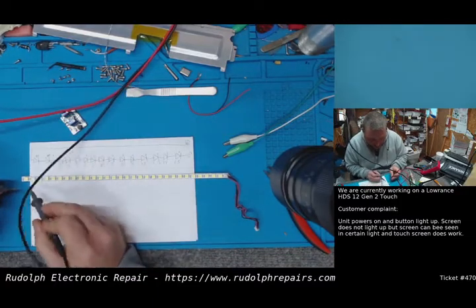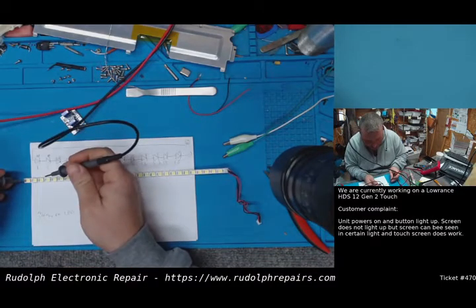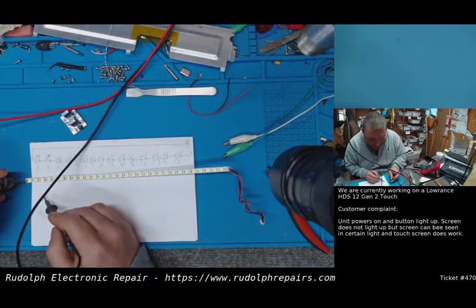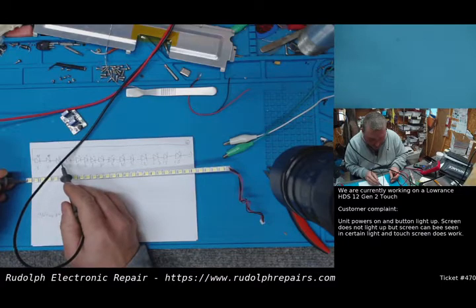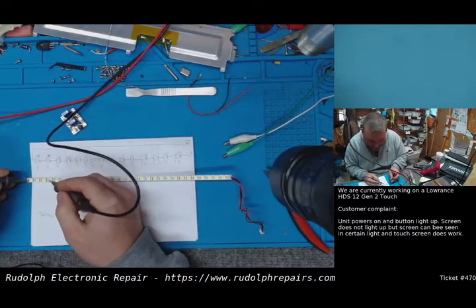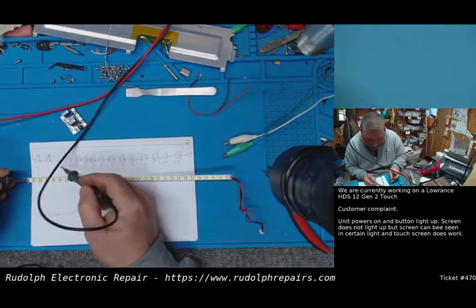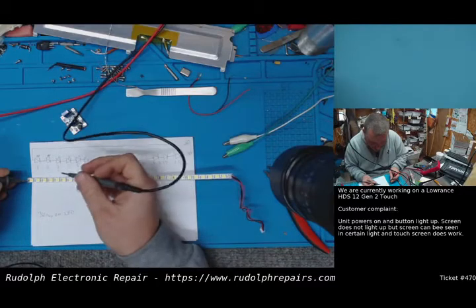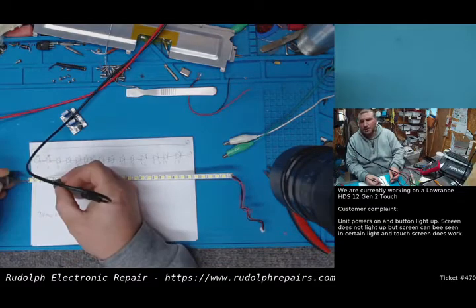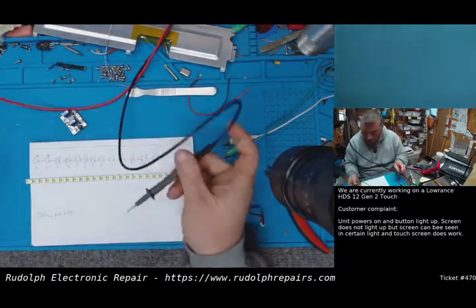So, like I mentioned, this LED is tied to this one, it's tied to this one, it's tied to this one, so it's every other one. So we're going to come to the left side of the left LED. We're going to skip an LED and go to the right side of that third LED. It's deceiving the way I drew this because I'm only drawing the connected string. So this is every other LED. So it would actually be 1, 3, 5, 7, etc. So sorry about the confusion there. There you go. Two LEDs. And by the way, 5.8 volts, extremely bright.